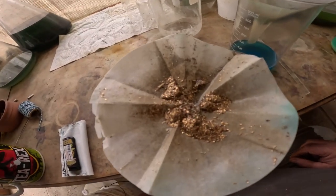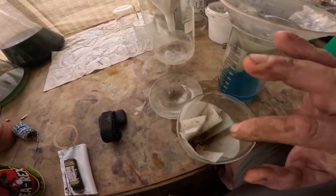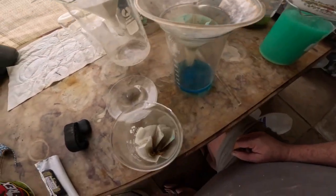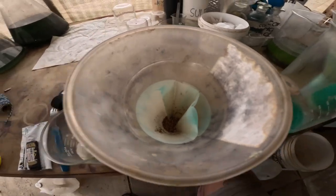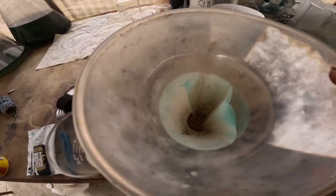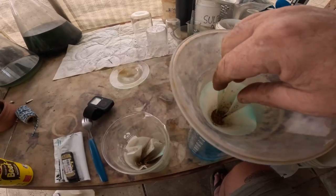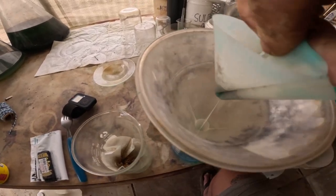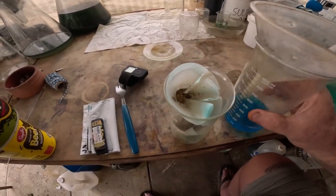All the legs have been consumed — all that's in there now is loose gold foils. Those little chunky bits you can see are the resistors that were in there; no big deal, we can filter those out once the gold dissolves. I'm getting rid of the nitric solution in filters, then I'll make sure all this gold goes into a filter. I'll wait until the filter empties before adding the last bit — that way it won't block up as quickly. There's all the gold in one filter, that's going to go into the beaker. The gold has all filtered through. Looking nice.